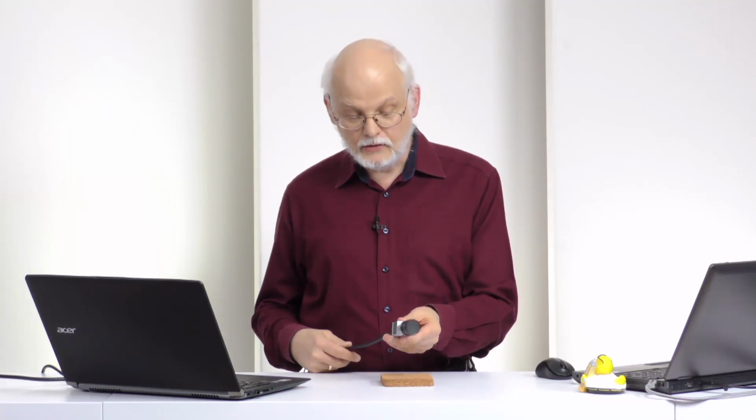At the moment we have not worked out all the details. This is actually work in progress going on in the standardization group, that we look for all the specific things which have to do with changing to a different wavelength. The same is of course true for the UV. Everything that basically converts electromagnetic radiation into an electrical signal can be handled by the EMVA 1288 standard.